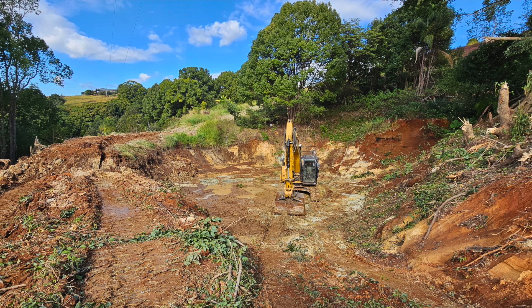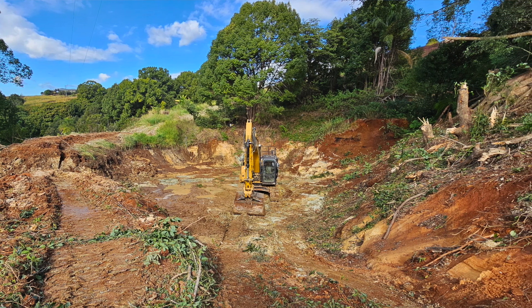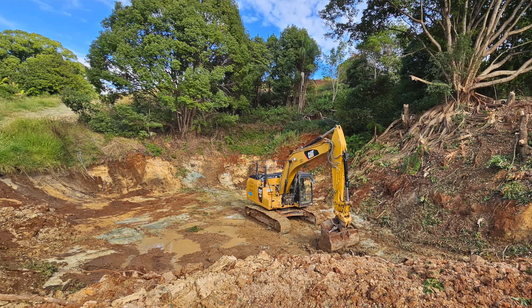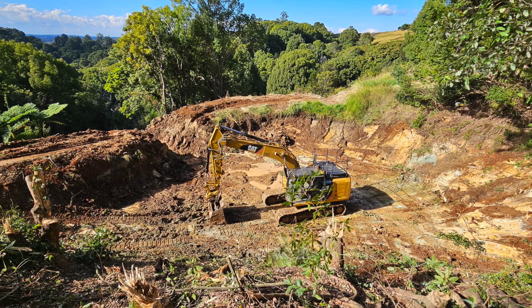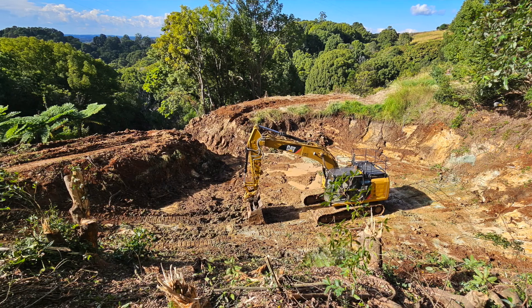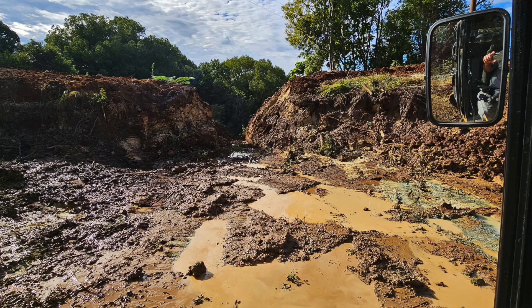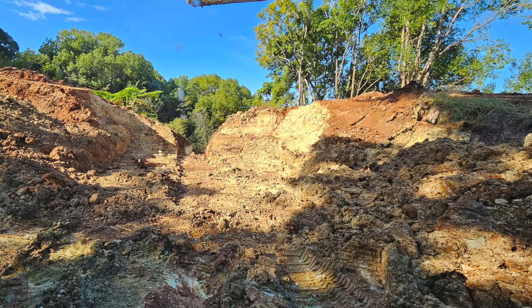So you built a new path into the dam and brought your 20-tonne excavator in. Your first job was to clean out the base of the dam and then you had to start rebuilding the wall. Now, you were talking to me off camera about keying in the wall. Can you explain to the viewers what you did? Well, once I got all the material out of the dam, it's a matter of keying the new part of the material back into the old part of the wall so that it becomes structural again — tying the new material in with the old and packing it down properly.